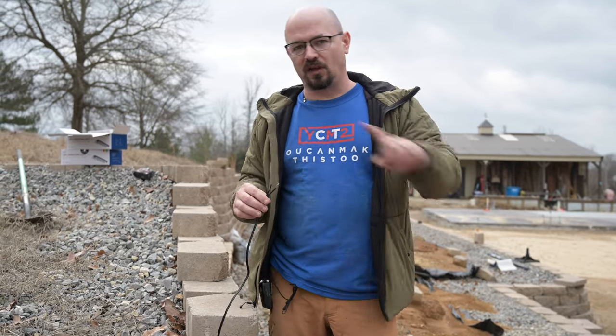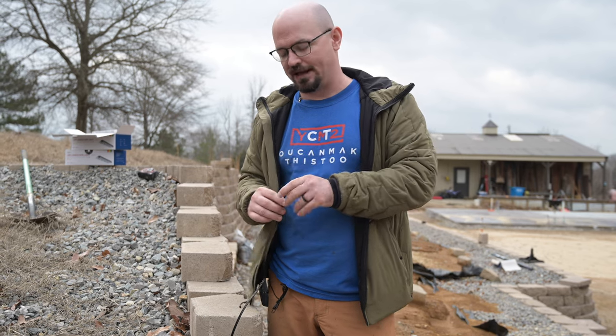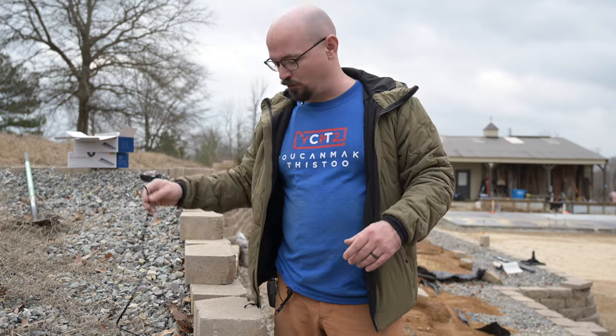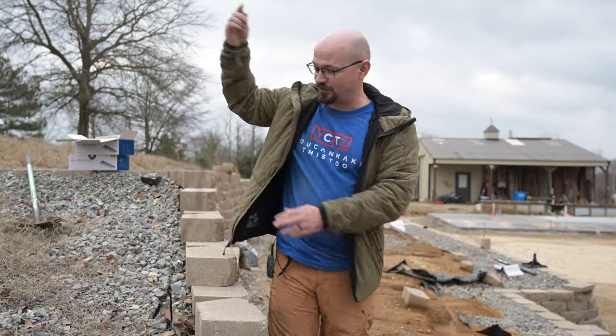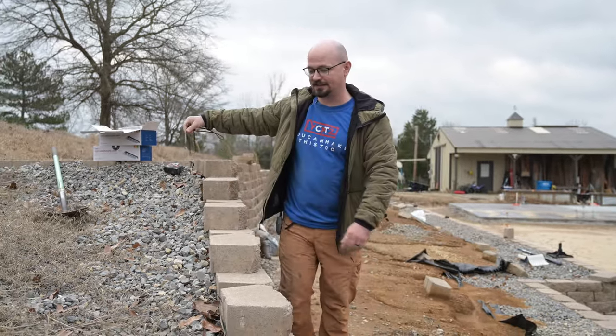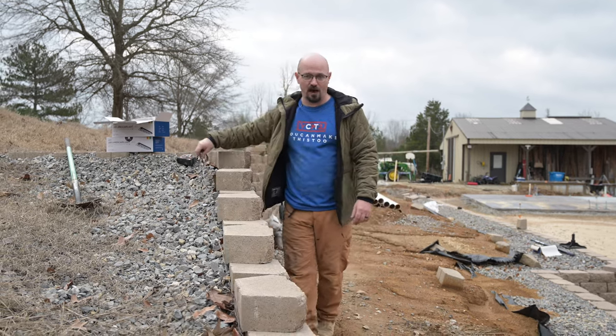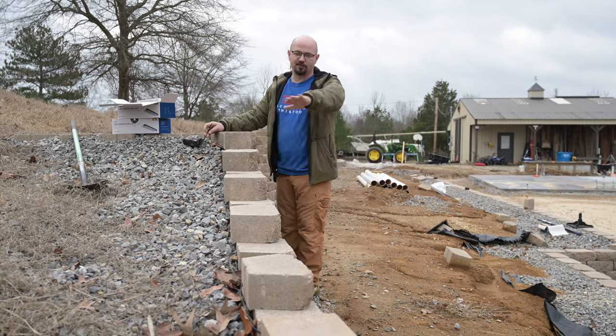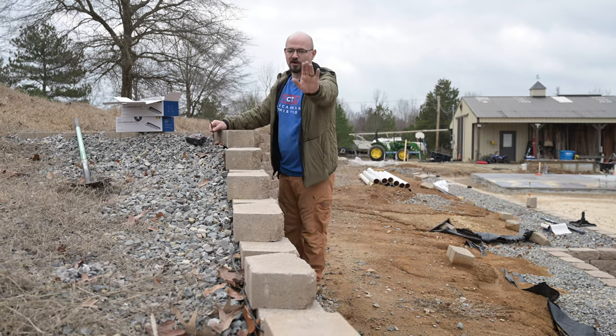So if I try to put all the lights on just one backbone, I'd be pushing the capacity of the wire. Running two, I'm totally safe. So it's gonna take a little bit more wire. But point being, this one I'm actually gonna untangle and run it back since this is the end, because this is gonna save me 10 feet of wire. And actually, because I'm gonna do it over there, it'll save me 20 feet of wire total. But the rest of them, I'll just leave bundled up with excess wire by the light.